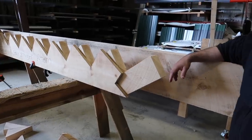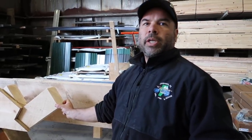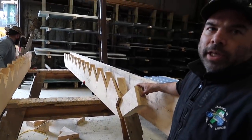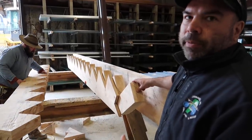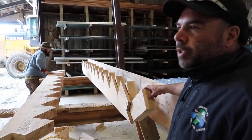What he's making here are special stairs that go in with our timber frame packages. These stairs are three by twelve — very fat hemlock wood. These stair treads are designed to be left exposed when it's done. It gives you a much beefier, heavier look — nice, oversized, good feel for when you have those stairs exposed on the finished product.